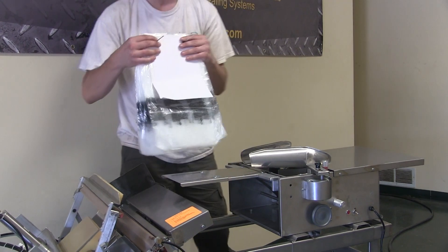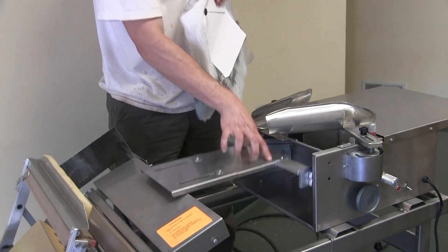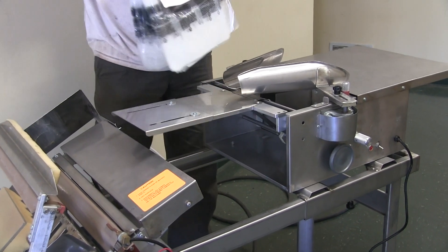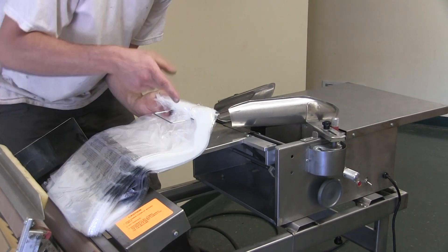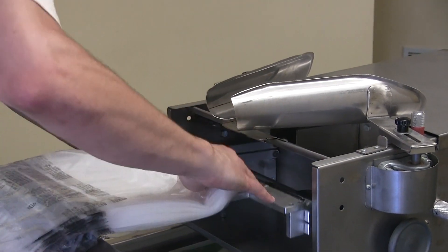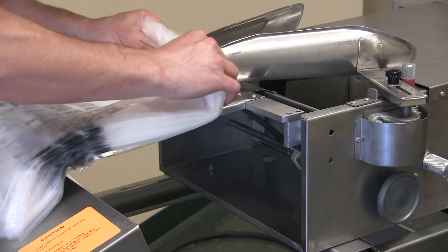This makes it a lot easier when we put these in. I'm going to go to my bag support plate and push down on this. You can see there's a piece of spring steel down in here. So what I do, I'm going to lay my bag's prongs away from me. I'm going to push down on that bar and push these two prongs straight down to the 6 o'clock position.